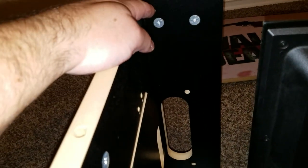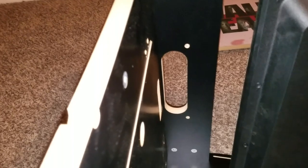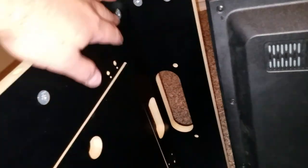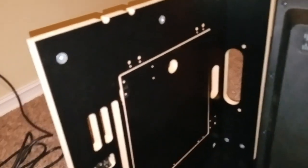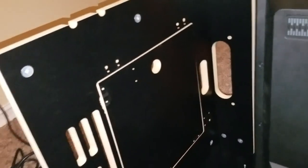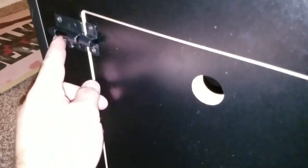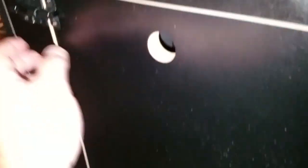I've put on the piece that attaches to the top — it's the smaller piece with the big hole in the middle. These can go either way, but you want the two holes to be more in the middle of the board. On the back door you can see there are three cams on the inside. You can just do the door on the outside since we pre-drill everything for it, if you're okay with the cams being on the other side. If not, just reverse everything and you'll have to screw in the hardware for the little trap door in the back. I did it so it looks a little cleaner — so there's no cams showing. There's a barrel bolt and a couple hinges, so I can just undo it and have access into the machine.